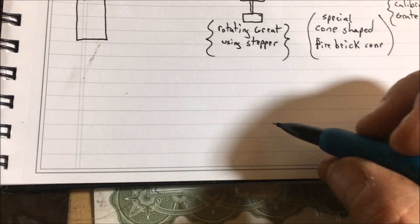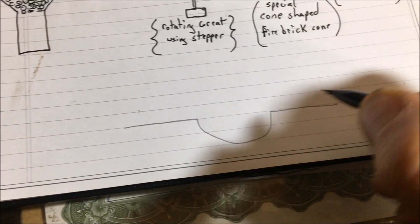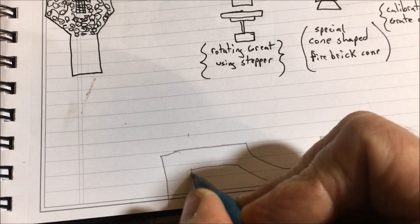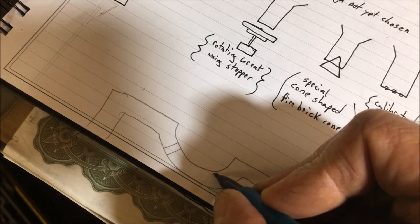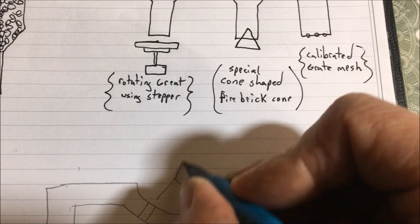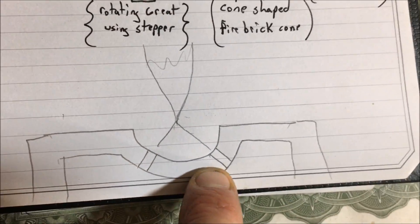The tip that we just saw is very similar to a rocket engine injection port. It works like this: you have a plate with a dimple in it — that's the top cap of the nozzle — and then you have these small holes drilled into the sidewall of that dimple. This is the geometry of the nozzle we just observed in operation. What happens is the jets spray out and impact each other, and I believe that's what's responsible for that fan-like spray that we see.